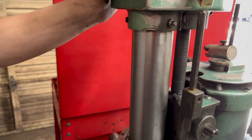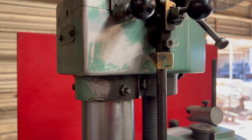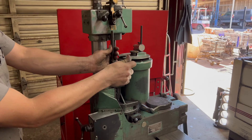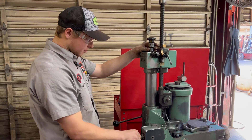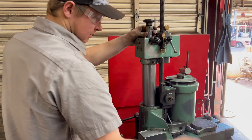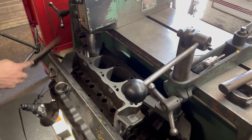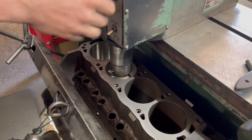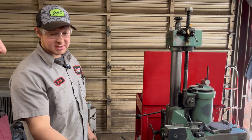We've heard it — it just cleared the cylinder wall. Now the stop is set up in a good position and will automatically stop the machine from going down and cutting through the bottom of the block. We'll adjust it a little higher for the next cylinder. Now if we're bringing the machine up, we're going to want to float it back so we don't drag that bit all the way up the cylinder wall. You're already set for the second one — so it goes pretty fast.